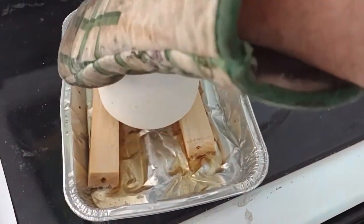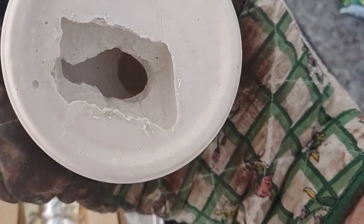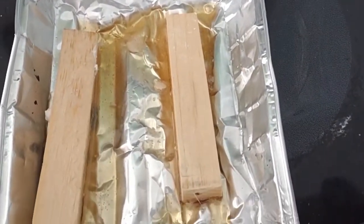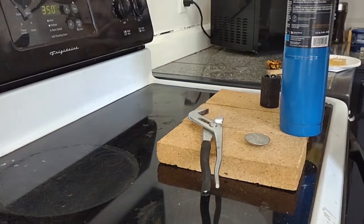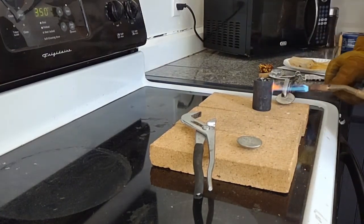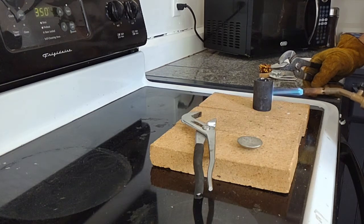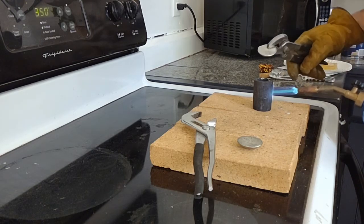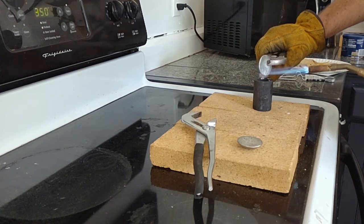We are now ready to do our metal casting with the tin. Obviously, be careful — the plaster casting is hot at this time. Don't burn yourself, and you'll be using very hot metals so be very careful. Tin is one of the nicest metals for casting at home because it has such a low melting point — it melts at about 400 degrees Fahrenheit and creates a very fluid metal. The lower melting temperature means I can melt it with just a simple torch at home. I put it into a crucible and I'm going to fill up that crucible with the tin before I pour it into the mold. I'm heating up the crucible first so that when I pour in the tin it doesn't solidify as soon as it hits the surface. And now I'm heating up the tin and putting it into the crucible.